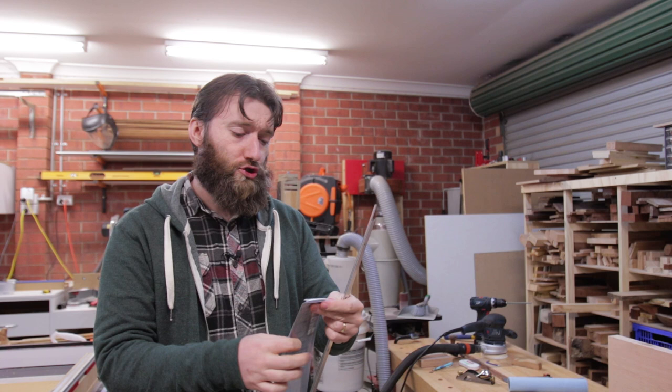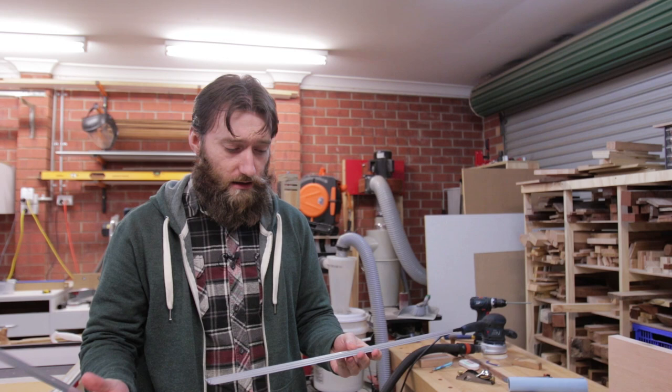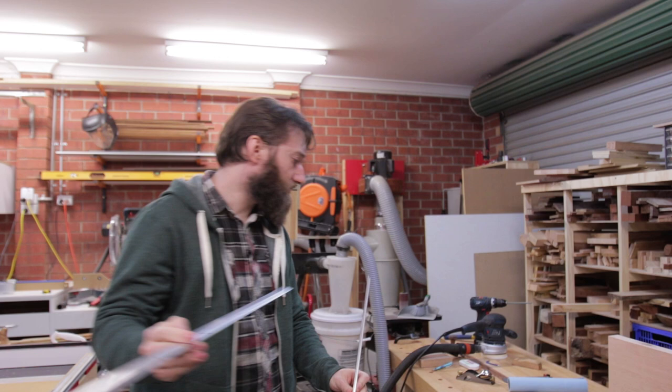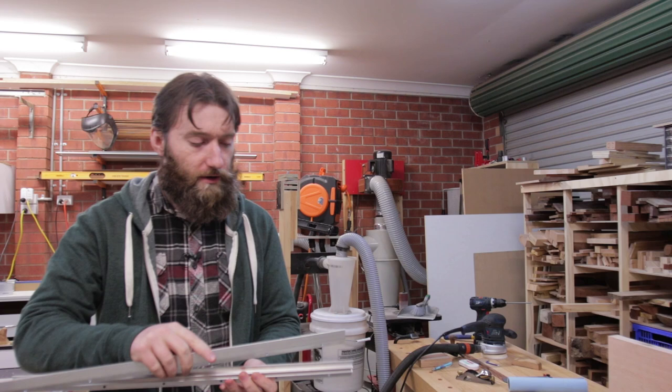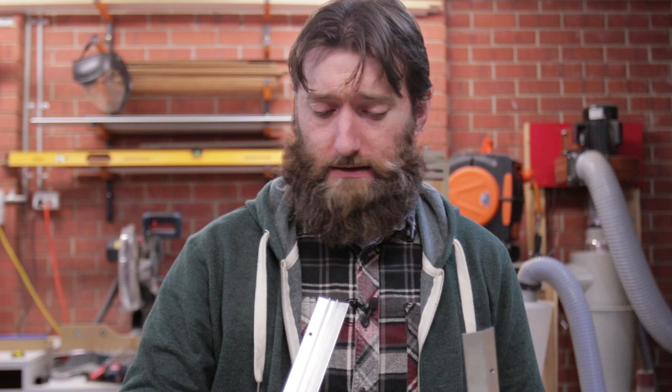I picked up some Shawhook Picture Hanging Rail from Bunnings — it's from the Zenith brand, not a sponsor, just what looked good. It's aluminium rail, basically like a French cleat but with a really thin profile. It supports up to 60 kilos, way more than what I need. One piece goes on the wall, then the matching piece goes on the artwork and slides down into it, locking into position. The problem is this is one rail and I've now got three pieces, so I need to cut it down. Aluminium is quite soft so any power tool or hand tool will cut it; I'm going to use the mitre saw.